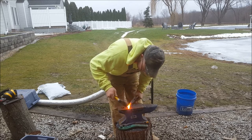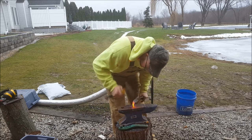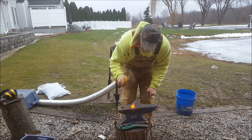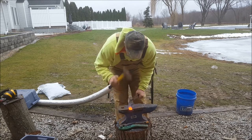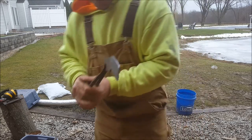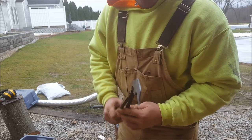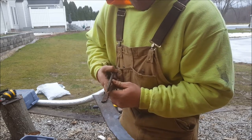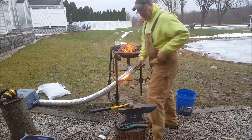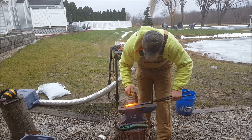I'm just taking and radiusing the corners a little bit — we'll do a lot of it on the grinder. Don't pay any attention to the blade because the blade still isn't straight, but that handle is nice and straight now. We got that blade hot and I can place it on the edge of the anvil.